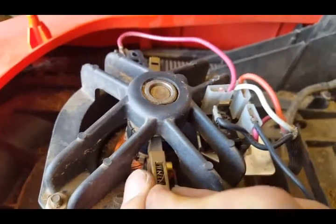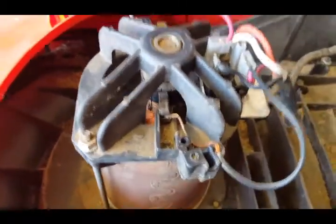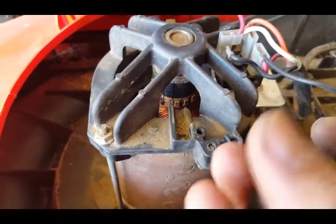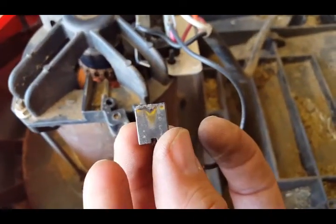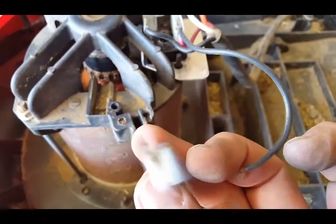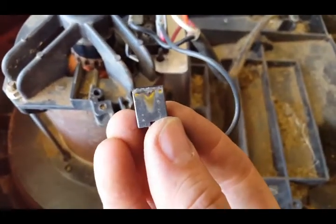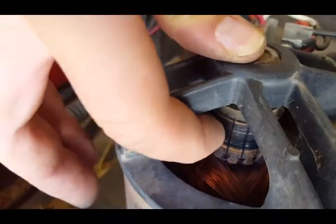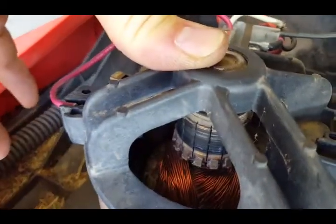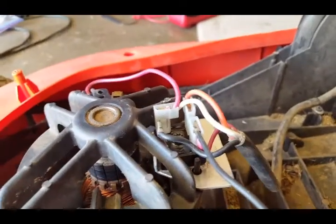The brush piece is wired to the assembly so you won't lose it, but look at this one — it's burnt on one side and totally black on the other side. What you can do is use sandpaper to clean it off and make it smooth again to ensure it connects nicely, because when it's spinning it needs to touch the contact part smoothly. Make sure you check this part too in case it's not your bridge rectifier or switch.